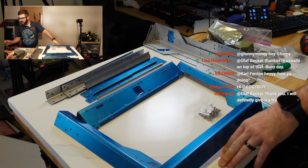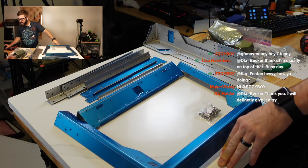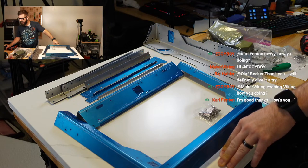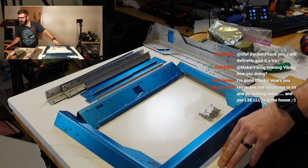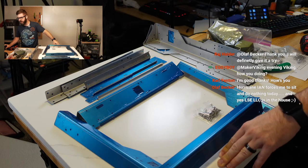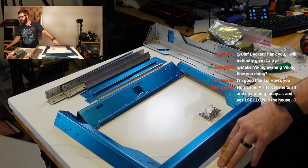Fasten stages, frame components, Loctite. Assemble loosely at first. Place it on a solid surface. When fastening the frame, hold the bolts steady and turn the nuts so they won't be stripped as easily. Holes on the frame might not be aligned if you fasten the nuts the wrong way, as shown below. Okay, gotcha. So basically, it's saying don't tighten something 100% and then move on to the next. Tighten all of them halfway, then all of them 75%, so in stages.